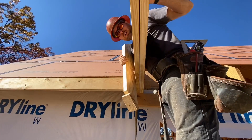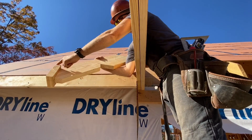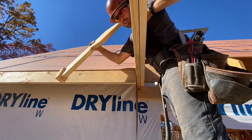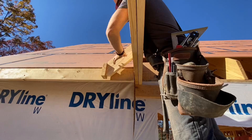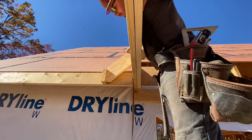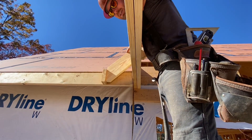We got our girder up here and I put it four and three-quarter inches higher than the wall in there. I finished my mock-up — I made the overhang a foot, which is what I want. I'll set it on top of this beam and see if we came out to the same fascia height, which is what I was doing all this for. You can see that if I set this on here and set the bird's mouth plumb, it goes right to where I wanted it. That actually worked this time — last time it didn't.